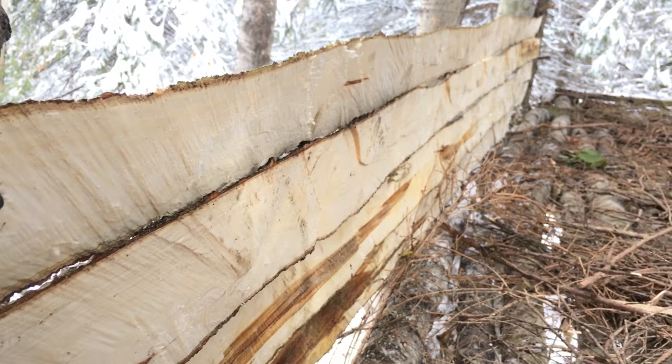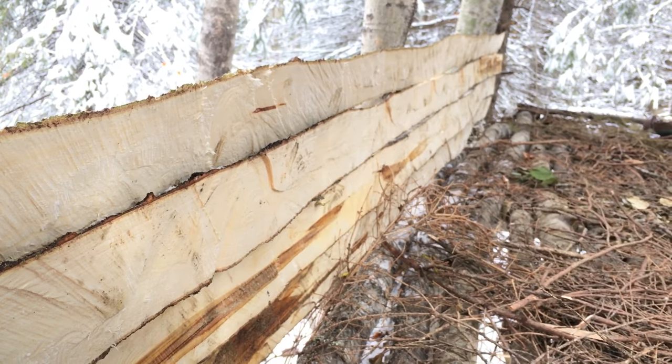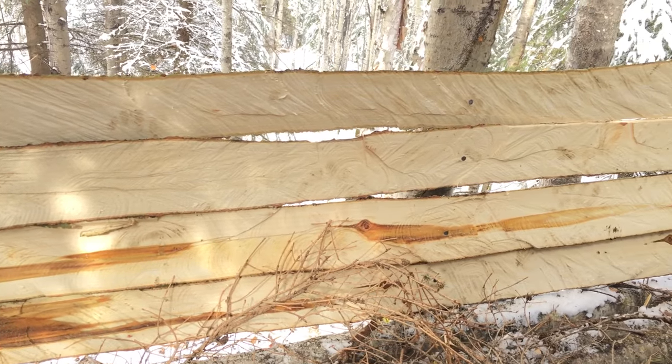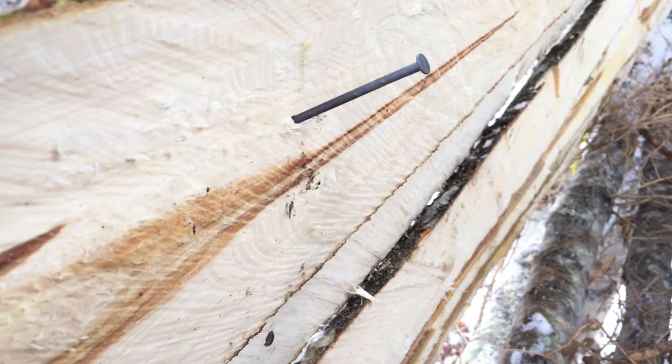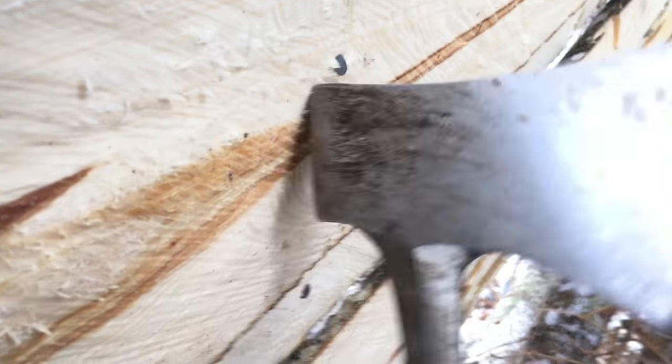This is green wood, so in order to preemptively stop the planks falling out as the wood seasons, I've been putting the nails in at like a 45-degree angle down, so they're kind of hooked in.